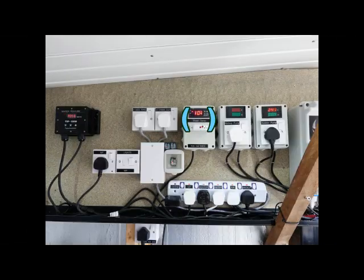There is heating for the pond, but only emergency heating — it only kicks in if the temperature drops below about 6 degrees Celsius. This is the control for that. There's a temperature probe in the water coming into the filter. You didn't see any heaters because I have four 600-watt drop-in heaters which sit in their own float pad, which sits in the outlet chamber, and they're only put into the filter during the colder months — which is why you haven't seen them today.